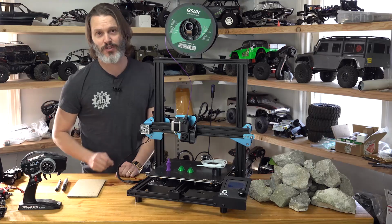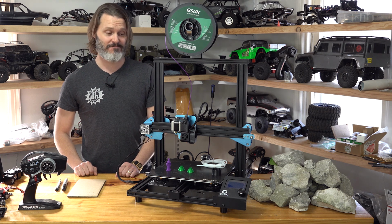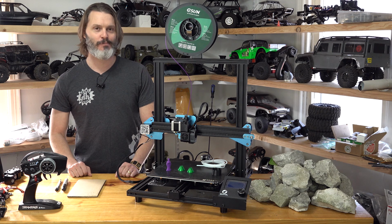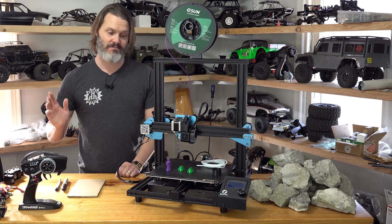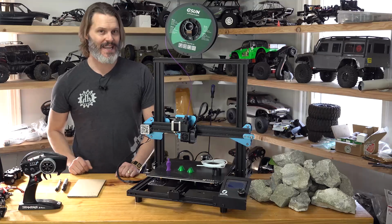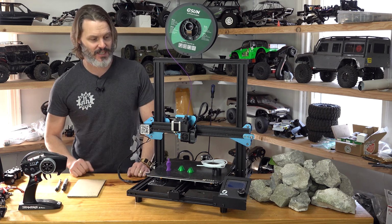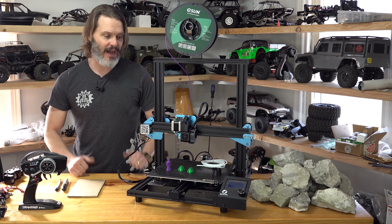I tried it on the Ender 3, big fail, couldn't tune out the stringing, and I said, you know what, I need a direct drive, and my old direct drive printer had bit the dust, so I picked up this guy for the job, and a couple test prints in, got it dialed in, and as long as I keep my filament dehydrated, then it is on point. Just print them all, absolutely no cleanup required on there, and I love it.